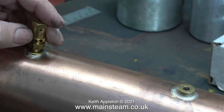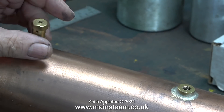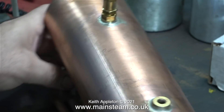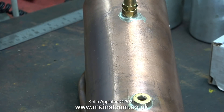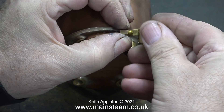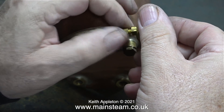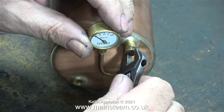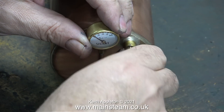Time now to turn my attention to the boiler fittings. This is a simple boiler fitting — it's a Stuart Models safety valve — and in this clip I'm fitting it in the correct hole. There are two holes on the top of these boilers. One is for the steam outlet from the superheater pipe, which is the centre pipe underneath the boiler. This provides very hot steam, which is just what you want for a cast iron model steam engine.